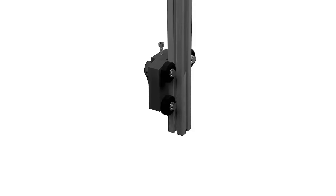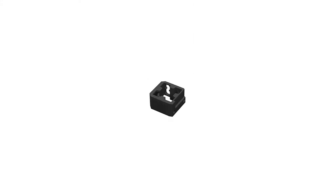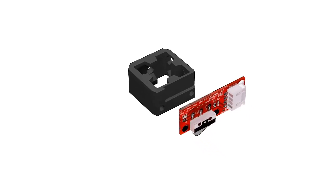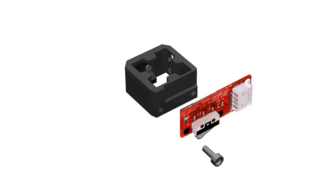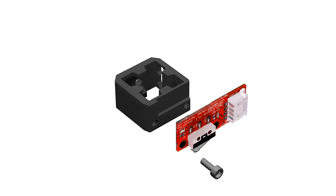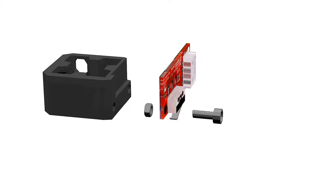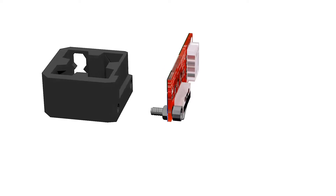Repeat this process for the three towers. Now let's move on to the end stop and end stop holders. These will be our go-to elements for calibration. Failure to set up the end stop holders correctly might result in infinite homing — meaning our printer won't know when to stop when looking for the end stop switch and will keep moving up until the motor hits something or breaks away from the tower. We don't want this to happen.